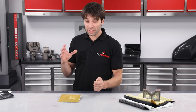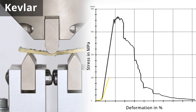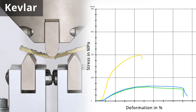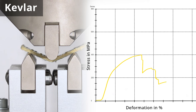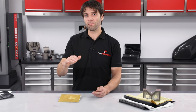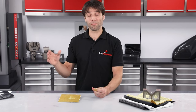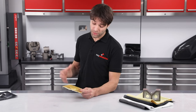Finally, looking at Kevlar: from the three-point bend data you can see it's significantly stiffer than both Innegra and Dyneema — though not as stiff as carbon — which is very useful to ensure the sledges don't sag, bow, or twist in use. It is also over twice as strong as Dyneema or Innegra. It does fail in a more abrupt manner than those two — you can see the strength stepping down as each ply in the laminate fails one by one — but even after most plies have failed and it's deflected as far as Dyneema and Innegra, it's still offering comparable strength. This fractured sample still has a huge amount of residual strength. This leads me to conclude that Kevlar has the best balance of stiffness, strength, and impact resistance for this application.